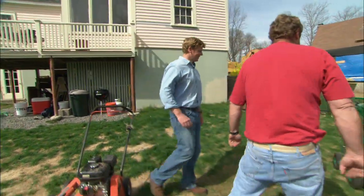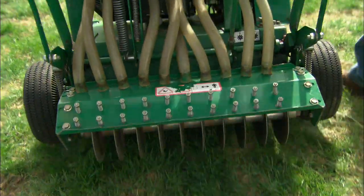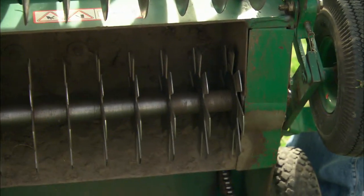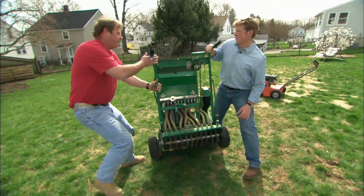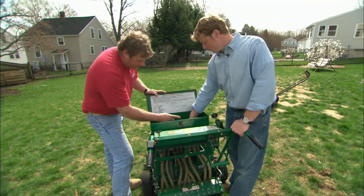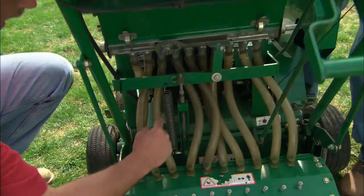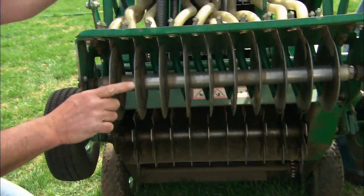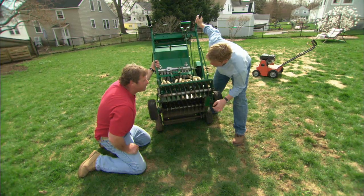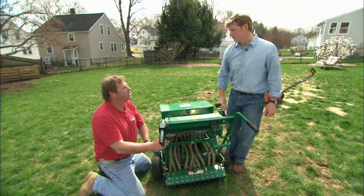There's a solution — take a look at this monster. This is a slice seeder. The business end is down here: these steel knives physically cut a groove down into the soil. Up top, we have a bin where we dump in all our seeds. There's an agitator in the bottom that pushes the seeds out and down through a tube where they land on a disc. The disc turns and pushes the seeds down into the groove cut by the knives. So the machine ensures that a seed gets into the soil — and when you're done, no cleanup, no raking.